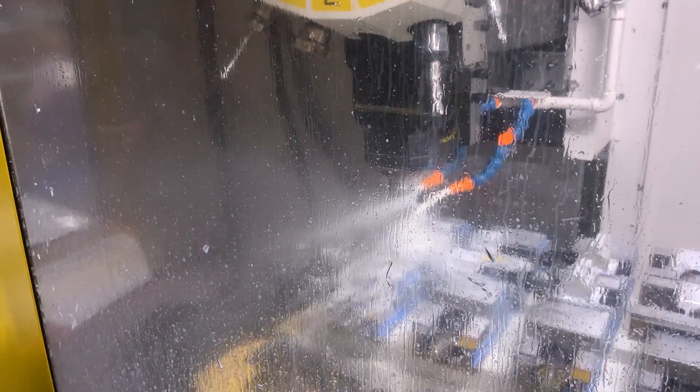With the pallets, the spindle is constantly turning. On the verticals we had about a four-minute changeover on a seven-minute cycle time — so 11 minutes per part, or 22 minutes for two. On the RoboDrill we have zero downtime, we cut a minute off the cycle time, and now we're making parts in six minutes.